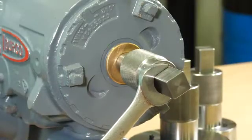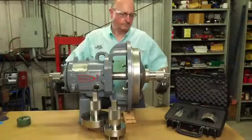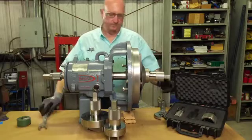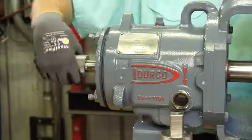Apply either a 1-inch combination wrench or crescent wrench to the squared head of the impeller wrench. While keeping one hand on the wrench applied to the impeller wrench, take either a 1-inch combination wrench or a crescent wrench and apply it to the squared end of the drive end socket. Then manipulate the shaft in the opposite direction of the impeller wrench until the impeller disengages.